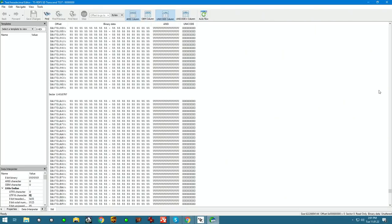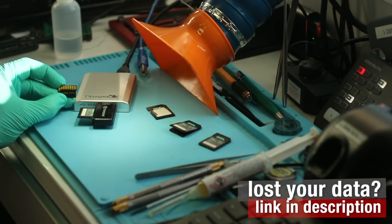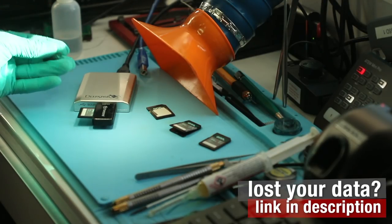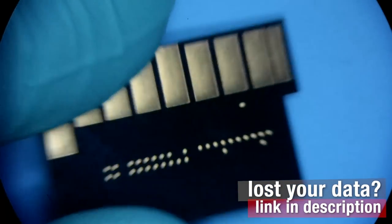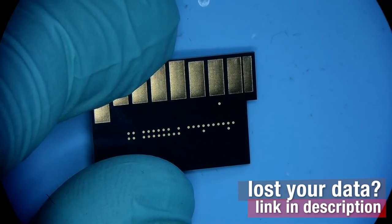If the translator is not loading, the firmware is not loading, we may still be able to get access partially to the NAND's properties to get the space and specs. But if the translator crashed, the data doesn't get translated. Just like the eMMC, it's one piece, but it has multiple components on the inside. On the outside, it's one piece, but everything is embedded inside, and what's embedded on the inside is a NAND storage where the data is kept and the controller that runs that memory.